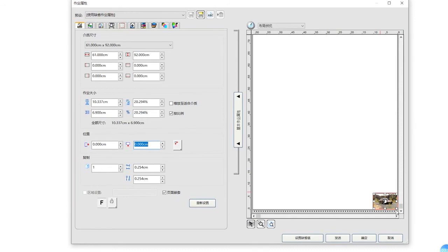But when you need to print on the mark, we should not let it start printing from the 0 position. On the horizontal direction, as we measured, we need to move to the left 9 centimeters. So it will start to print from where you need.